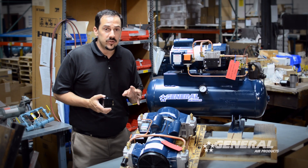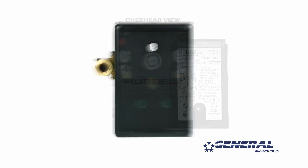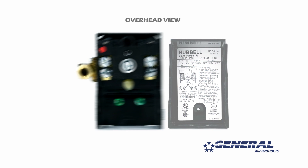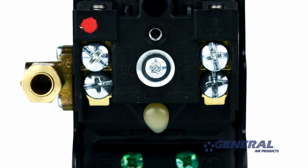The 14-pound differential must always be maintained. The key to adjusting the pressure switch correctly is knowing which parts you'll be working with. Begin by removing the cover. Note that there are pressure switch adjustment procedures inside the cover of every one of our pressure switches. The first part I want you to take note of is the electrical connection terminals for incoming power and power to the motor.